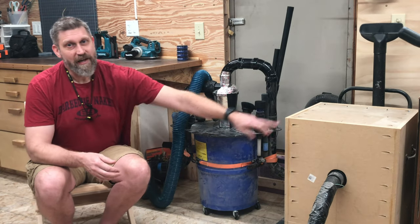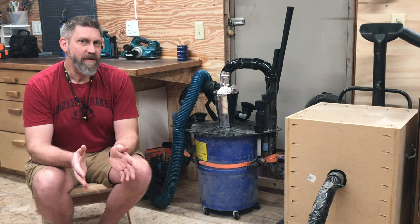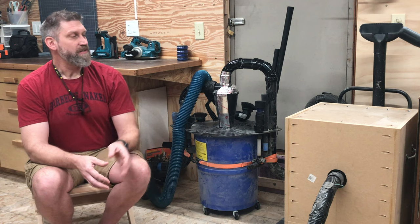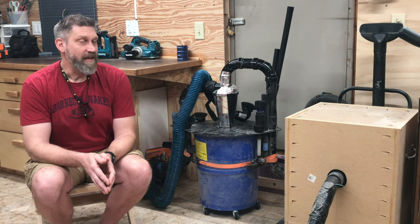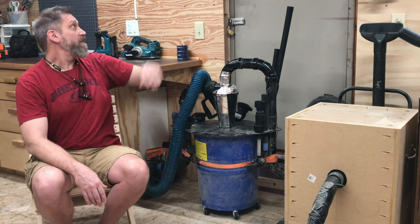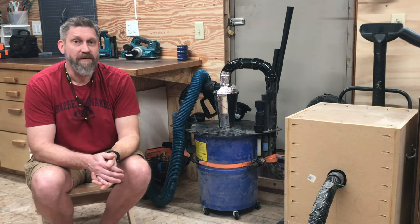Inside this MDF box is a shop vac, and it's one of the louder tools in my shop, so I wanted to address that noise issue. So I made this MDF box and I lined it with carpet on the inside, and that works really well. It operates with a remote. I can use it without hearing protection.